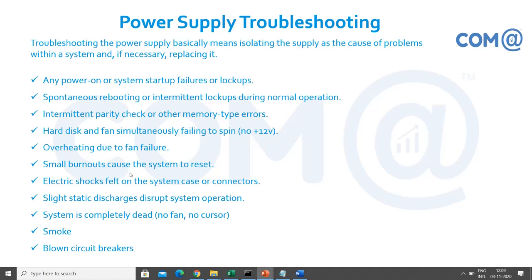If you are facing this kind of problem, first report it to the electricity board and ensure you have proper voltage, no fluctuation, and proper earthing. If you have machinery-based residents nearby, tell them to take the power supply from a different line, not from the same line where we are taking. There will be three phases available, right?